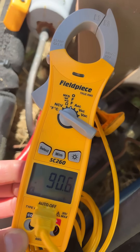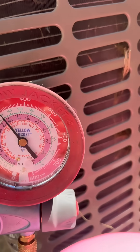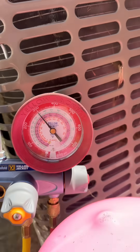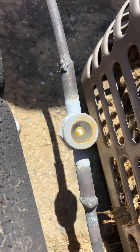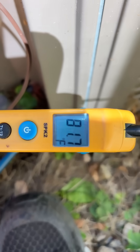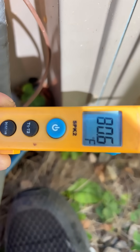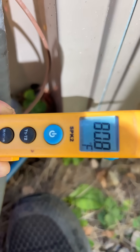At about 91 degrees liquid line temperature, pushing over 96, 97 degrees saturation temperature, so I've got sub-cooling — I've got at least five degrees guaranteed. I've got a sight glass that's about topped off. I'm not expecting much sub-cooling until that thing's topped off. The outdoor temperature is about 82 degrees, and right now my saturation is up about 95, 96 — so we are climbing above outdoor air temperature, which is about a 15-degree increase at this point, which is good.